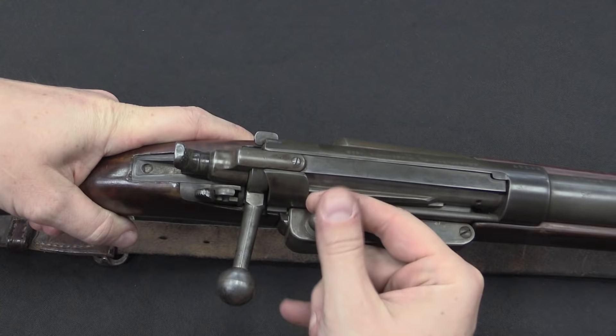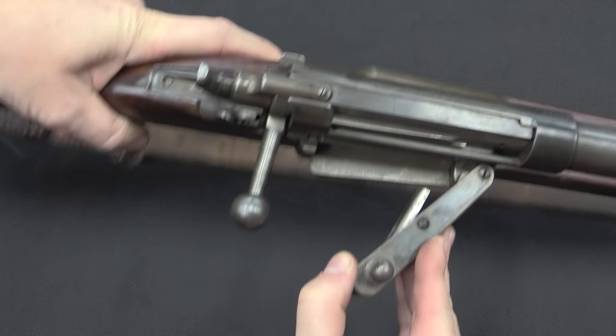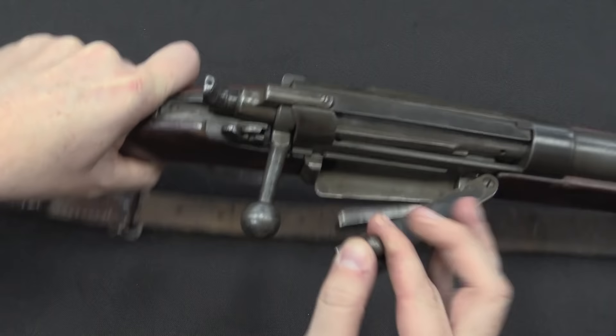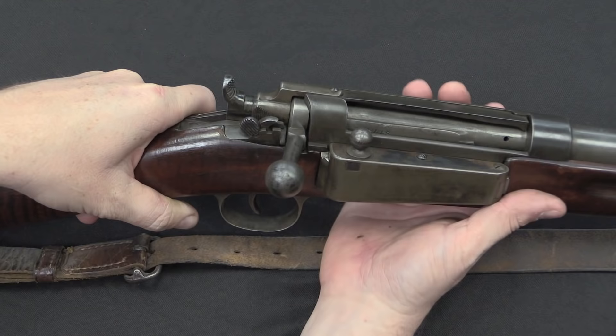Let's take a closer look at a couple of the features here. The magazine has this handy knob handle on it, with a little spring-loaded catch. You can pop it open and see the follower right here. When you open the magazine fully, this little piece cams the follower all the way up into the door so it's out of your way. You drop cartridges in — it can hold up to five — and this is a rimmed cartridge, so you just plop five in there. When you close the magazine door, the follower comes out, loads the rounds up, and you lock the magazine shut.